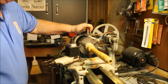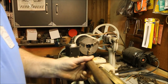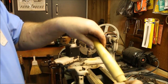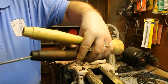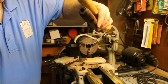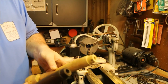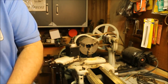That was maxed out in capacity on the length of the bed. Did manage to drill the hole down to the same depth. I think I need to modify the wood lathe so that I can drill through the tailstock. It's got a much longer bed.